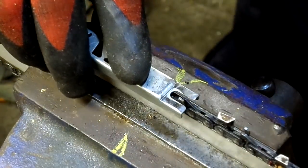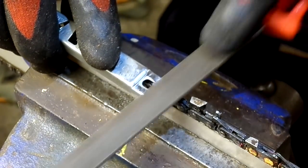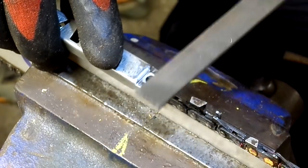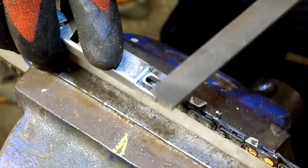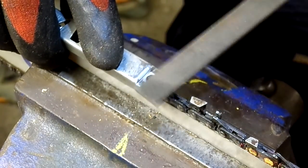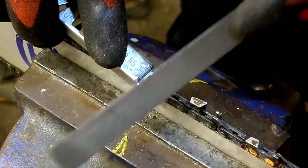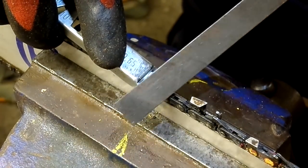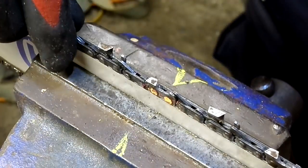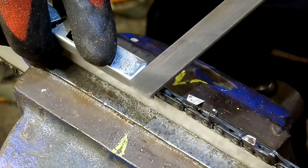Put it on, move it back. I'm doing this with my left hand — not the best, I don't want to be in the way of the camera. You take that off until it stops. See how much we've took that raker back — that's how much I'm taking off, and then just round that off a bit. To be honest, I've taken more than I should off on certain jobs and they really dig in and cut better, on softwoods as well — they take off more.